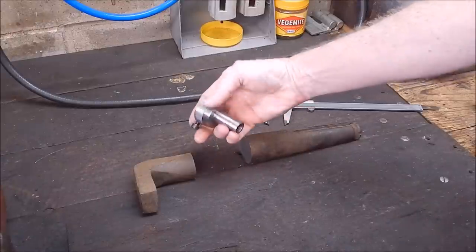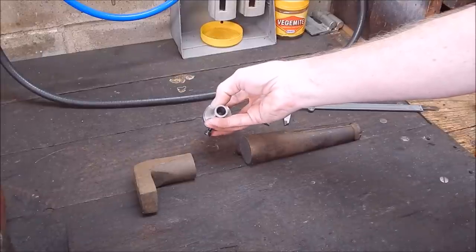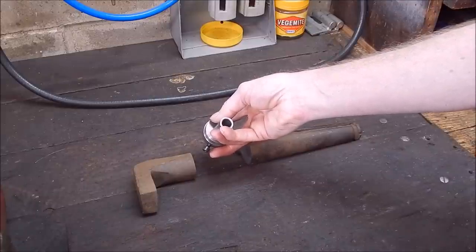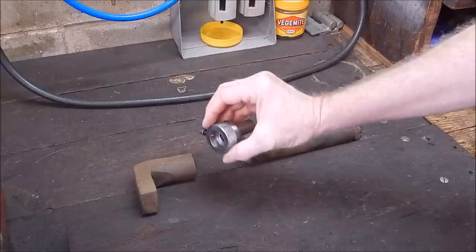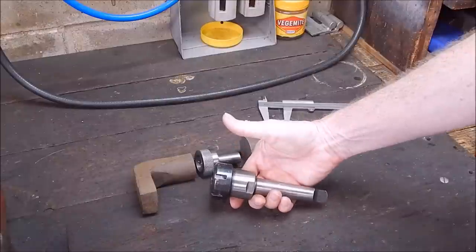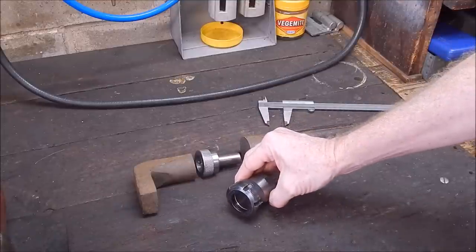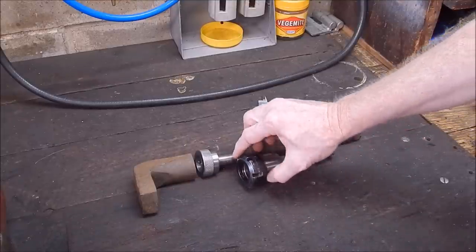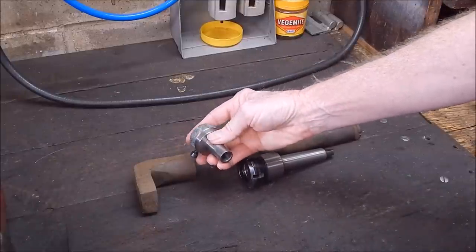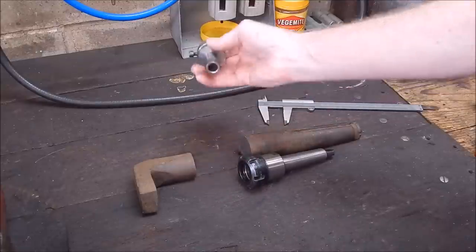It machined up beautifully — it's got a half-inch feed-through on it. You can't use this in a 13mm chuck in the tailstock; you'd have to have a three-quarter or a collet. This is why I always now use a collet system — a collet chuck in the tailstock. It doesn't mark your drills or tear them up, and it won't tear up your nice pretty die holder when it jams. It holds it like a leech and won't damage anything.